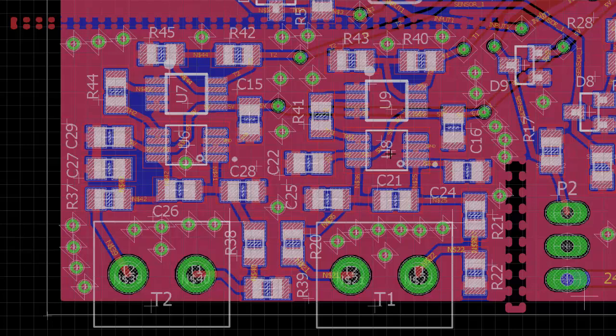So they would both rise, but the one that was closer would rise a little bit more. And one of the ways I tested this was I said, okay, I think this is the problem. I took a heat gun, I turned it on, I pointed it at the linear regulator, and I could quickly see the temperature rise on my thermocouple readings.